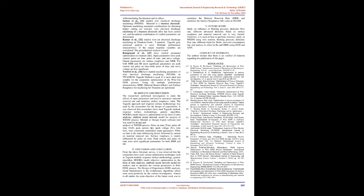Nithyanandam et al. [22] concluded that titanium is an important material in many engineering fields with properties like high strength-to-weight ratio, superior corrosion resistance, and thermal properties. It has applications in aerospace, biomedical, and automotive fields, but is considered difficult to machine due to poor thermal properties and poor machinability. Sneha et al. [23] studied wire-cut electrical discharge machining (WEDM), which is frequently used for making complicated shapes, especially for very hard materials and complex workpieces. Since there is no physical contact between tool and workpiece, delicate sections and weak materials can be machined without distortion. For having lower kerf width, lower pulse on time, higher current, and higher wire feed rate are suitable parameters.